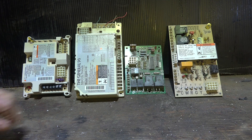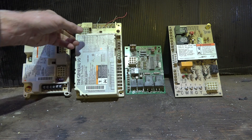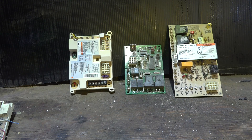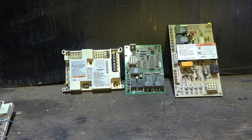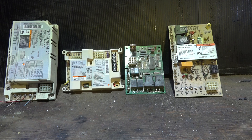I'm calling this one one of the oldest ones — this was from the early 90s. This one right here, still a White Rogers, is a general replacement one. It was kind of a giant leap when they started doing these things, because they made these so that they would fit a number of different furnaces, with different adjustments to make for each different furnace. They took away this issue of having one of these controls for every model and size furnace.